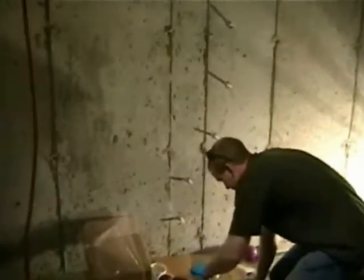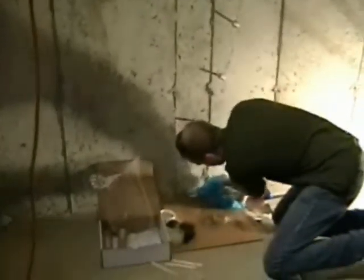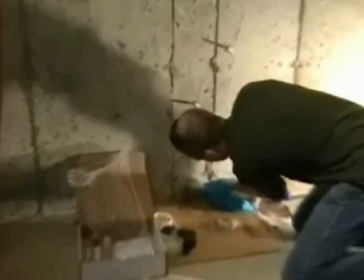It tends to leak more than the top does. Rarely would you see a crack leaking over 3 or 4 feet off the ground. We still want to fix the whole crack, but usually they leak more towards the bottom.